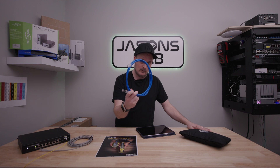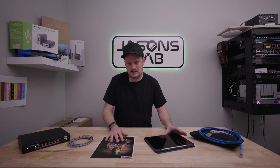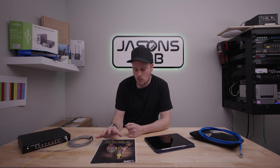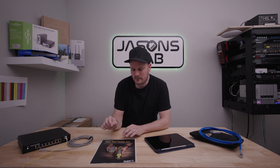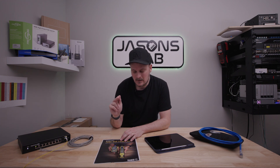It's digital. Most tone kits that you use for toning cables or phone jacks will do analog and they do really well. There's a lot of products out there, many people make them, but this one stands out the most because it's affordable. It does digital, and the reason why we want to do digital is because if we plug normal or other branded units into an active switch, it shuts the switch down or causes issues, or it doesn't tone properly because it claims as a dead short.